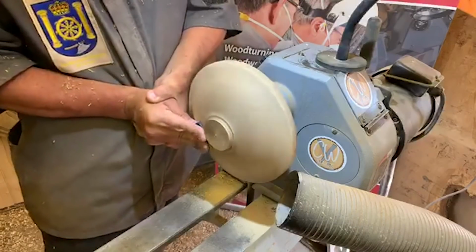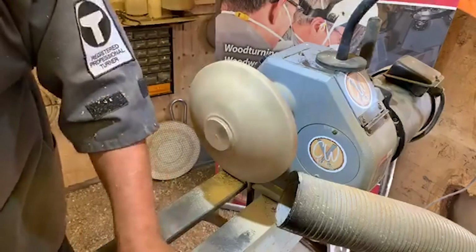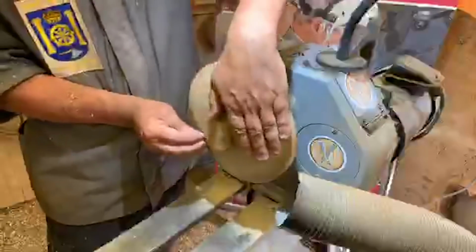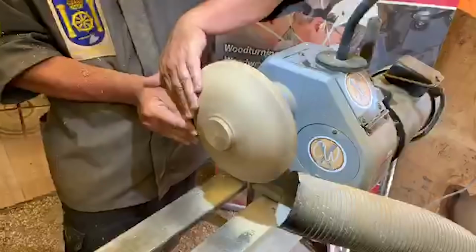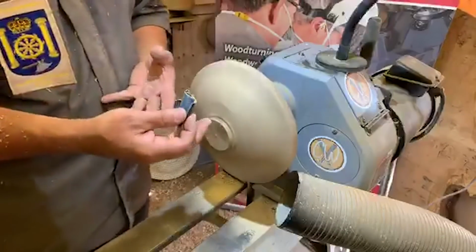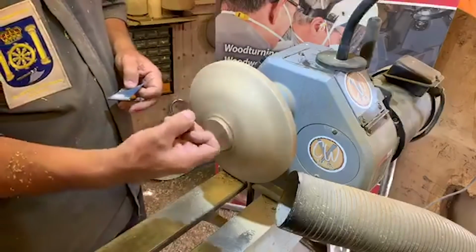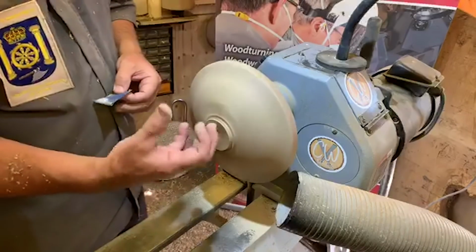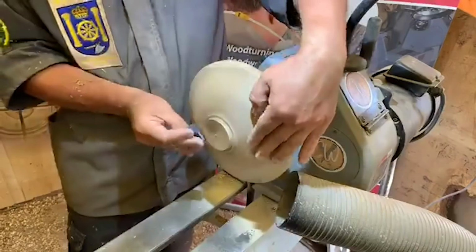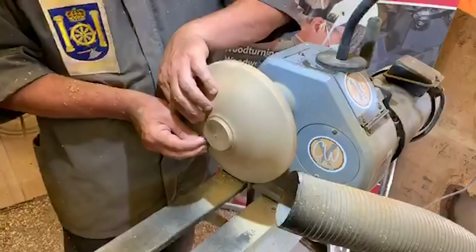What about wet sanding? Yeah, wet sanding is okay for exotics, for smaller pieces, for acrylics, polyesters, all those sorts of things. The trouble with wet sanding on a piece that's so dry as this is it will probably cause you a few more problems. You could though wet sand, so spray it on your final grits to raise the grain, that will give you a lovely finish. But there would be no need on this sort of piece. But your exotics, definitely. Wet sand or sand with wax.